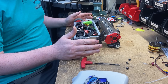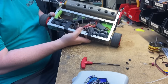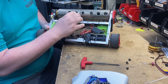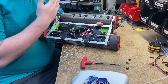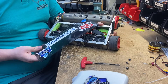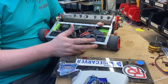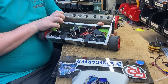So, all those things being said, hindsight being 20-20 — if I was to rebuild this robot, I'd literally cut off the hub motor section, cut off one of the final teeth, and remake it with a shorter drum with just five teeth. From there, I would ditch this aluminum frame. We'd do two uprights out of Tegris, because I built this robot with bulletproof glass and aluminum — pretty similar to how we built robots 20 years ago — but everyone's doing Tegris and TPU now. Tegris when you need something rigid, and TPU when you need it to flex. So: shorten the drum, do a belt to run that bigger motor.